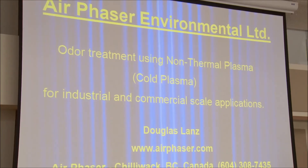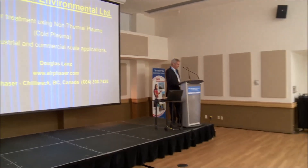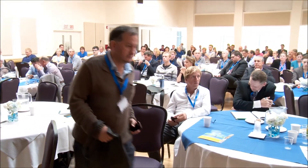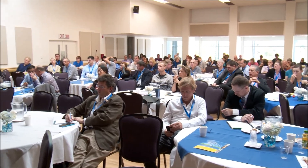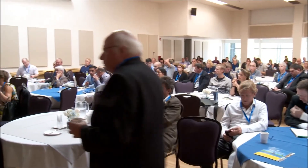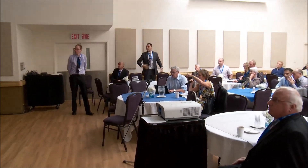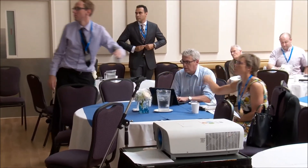That's a picture of the field again, which is not UV tubes. Thank you very much. Are there any questions for Anthony? So I'm interested in the feedback — you mentioned you can measure ozone. What you do is keep the airflow constant through the dielectric barrier or through the plasma field, and you modulate the field to be less intense, just like a light dimmer.